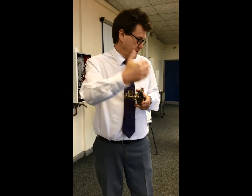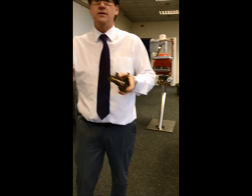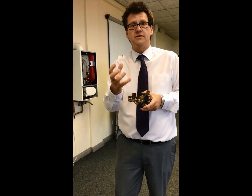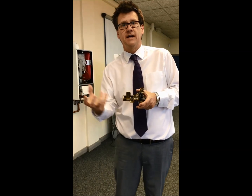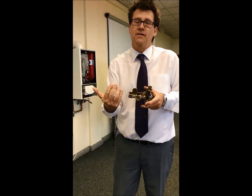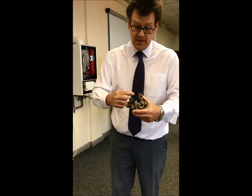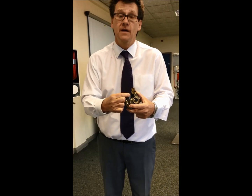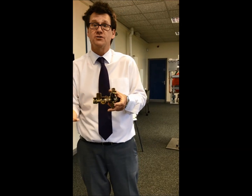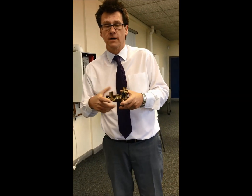Because with modern valves, which we're going to look at shortly, especially when you've got a plastic block, you guys are fitting mini expansion vessels and you're fitting anti-shock valves on the cold main. Well, there is an argument to say we're going backwards, not forwards, because this valve, there's your anti-shock, and there's your mini expansion vessel. So it was built into this valve, so it wasn't necessary. So the power of marketing is a very clever thing, but here we go.